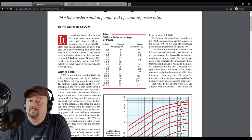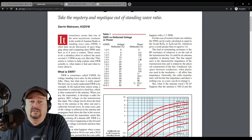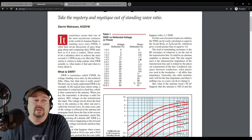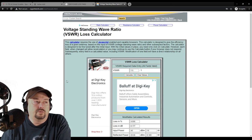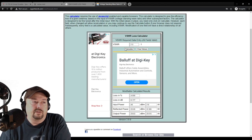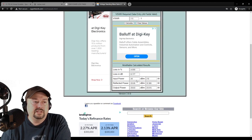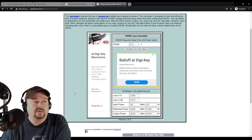If you have any ideas or I'm doing something wrong, I'd love to hear it — go ahead and post them below. I'd like to see folks who have the 705 test their power output on 440 and post it below or make their own video. Using an SWR calculator with 1.5 to 1 SWR and 10 watts input power, output power comes to 9.6 watts, with only 0.38 watts of reflected power — not 4 watts. So if you have a reasonable explanation, go ahead and post it below.